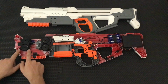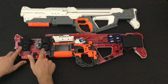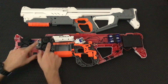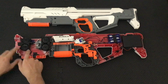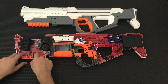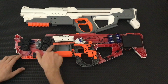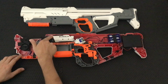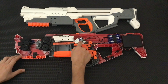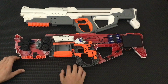Starting at the front, both of the stages are 3D printed. They both have the black smooth worker wheels. And then this first stage is mounted into the Hyperfire screw post. Second one is mounted onto custom screw posts that I had to transplant into the Centurion shell. Don't worry, it's more jank. The Hyperfire belt pusher is actually glued down because I accidentally chopped off that piece. And then the pusher motor is secured in place inside the larger housing with scrap pieces of plastic.